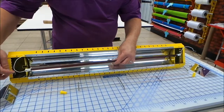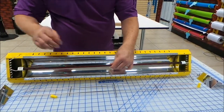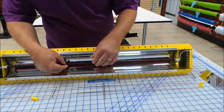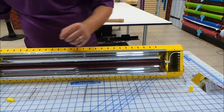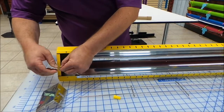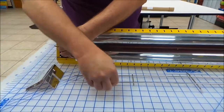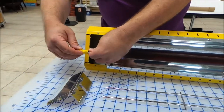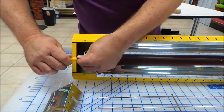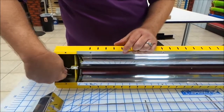In this case, you'll notice that the wires are on one side of the unit. It's simpler if you insert the bulb so that the wires are sticking out. From there, we just grab the two wire connectors together. Using our screw-on tab, you're just going to screw on, making sure that it's screwed on very tightly and that you get a good connection between the two wires. And you're going to push it right back in.